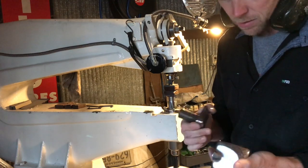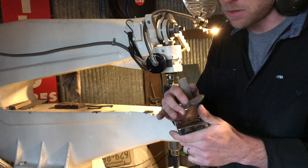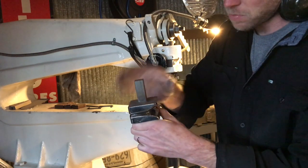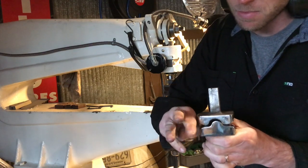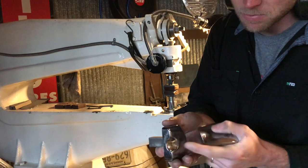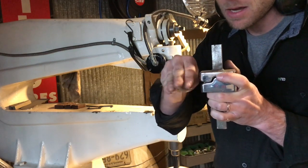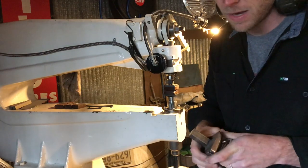But these are shrinking dies that are not a good profile at all, in my opinion. But you get an idea of what it looks like here, okay? So you've got what's called a thumbnail die, and this sticks up. It's kind of a triangular shape to it. And as I feed the metal in this way, hammering up and down, it's going to make what we talked about earlier, almost a pleat or a tuck. It's going to raise the metal up as it comes across this. So if this is your metal, it's coming up like this. Now when it comes back, everything comes together, all this shape comes together at a point, forcing the metal into itself. Now when the metal's forced into itself, you have this much metal that's been raised, and as it comes back, it's being forced in, it's going to shrink it, get smaller. Well, it has to go somewhere when it gets smaller, right? So it's going to curve over. That's how you use shrinking to obtain a radius.